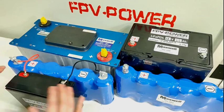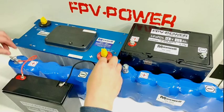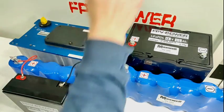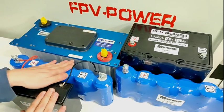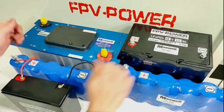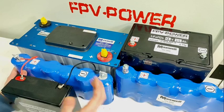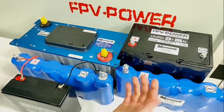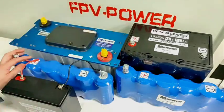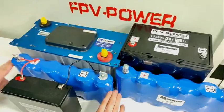But what we've got here is a battery parallel to a supercapacitor. And the supercapacitor will be the main point of contact to the starting engine. So when you crank over, even though these two are sitting at, let's say, 13.8 volts, when you crank over on that V12 12 liter diesel, it's going to take hundreds and hundreds of amps. Let's just call it 800 amps, maybe 1,000 amps, or even say 1,900 amps, the maximum that this can give. But round up, we'll go 1,000 amps being pulled for a couple of seconds, 1 or 2 or 3 seconds. This will give it all, and the voltage of this will go down.